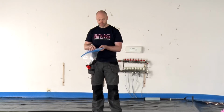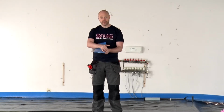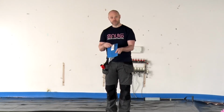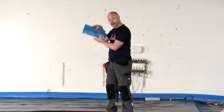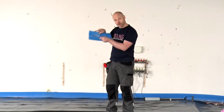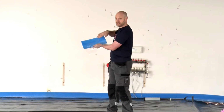On the edging strip, you have a double-sided tape on one side, and then you have a cellophane on the other, and the cellophane is fixed so that you have a small side and then a large side. The way this is designed to be fixed is that the double-sided tape will come off and be fixed to the wall, and then the small side would sit behind your Celotex, so your Kingspan insulation. Then your cellophane would sit on your insulation in line with the top of the insulation. That would then be fixed with a tape, and then your top side would sit flush with your wall.